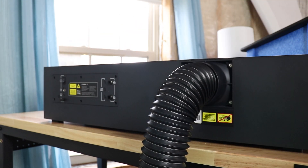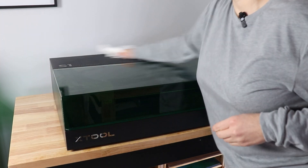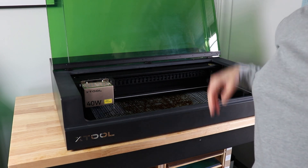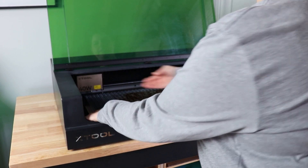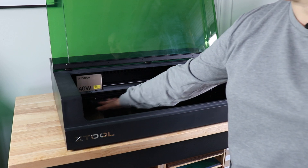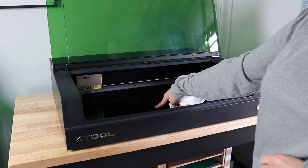The hose is attached. I'm going to leave everything else unplugged and roll this back in place so we can access the front of the laser. You can start really simple by just wiping down everything on the outside of the machine. If you are working with any kind of wood or anything like that, you're just going to get dust everywhere, so just wipe it down with a damp cloth. Next, let's open this up. I'm going to start by removing my honeycomb. This is a very dirty honeycomb, so we'll address that in a moment. Anything you leave in here can be a fire hazard while you're using your laser.